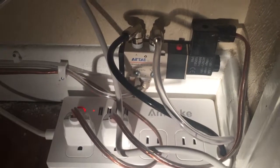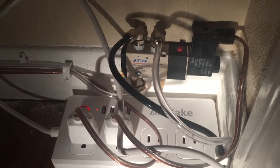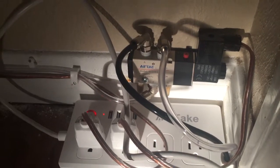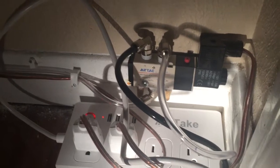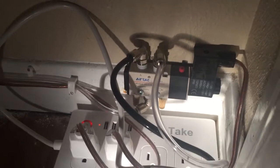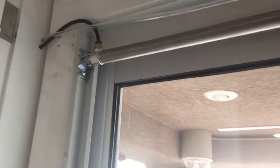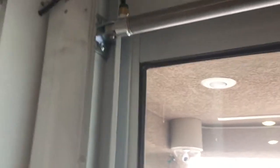When this solenoid is powered down, the air is automatically in one position. Once the power is activated to the solenoid, it switches and pushes air through another valve to another position. So when that air kicks on that first time and this solenoid is not powered on, the air travels from one port to this rather large actuator mounted up here. Right now the air is in this position, which is forcing that actuator to be in the open position, forcing the door to be closed.